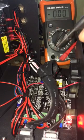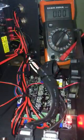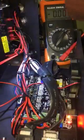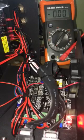Basically, the V-ref refers to these little pots right here — you have one, two, three, and four. They correspond with the X axis, and you can see it says X on the side of your board. If you read it, it says X, Y, Z, and then you have E0 for your extruder.